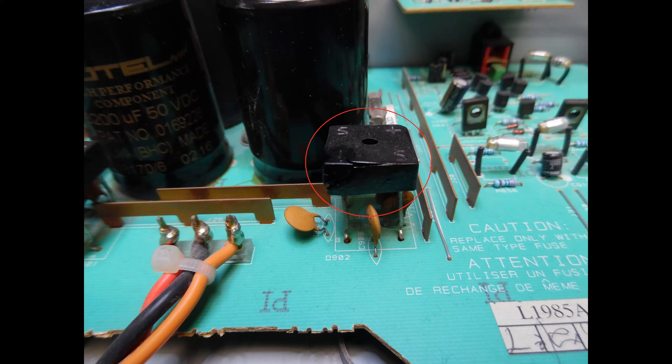The first thing to look at is these small brown ceramic disc capacitors — there are four of them and their purpose is to act as a high frequency filter. After rectification and smoothing, any high frequency noise is effectively eliminated by these 100nF ceramic disc capacitors. It's not uncommon on many amplifiers for these capacitors to go short circuit, so it's not always the bridge rectifier or diodes that fail — it can just be the capacitor across the associated terminals.